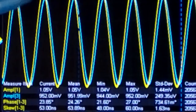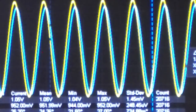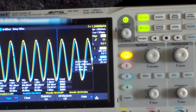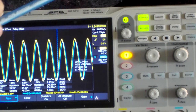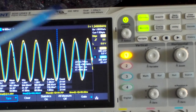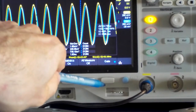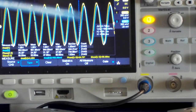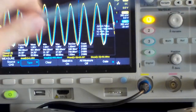What is also important with a scope like this is that you do not use the fine-tuning of the voltage. You can normally select volts per division and fine-tune to zoom into your sine wave, but I noticed the voltage values measured are not correct with the fine-tuning applied. I found this by connecting probes to the calibration reference: I should have 3 volts, but got 3.12V on one channel and 3.04V on the other after using fine-tuning. So don't use fine-tuning.